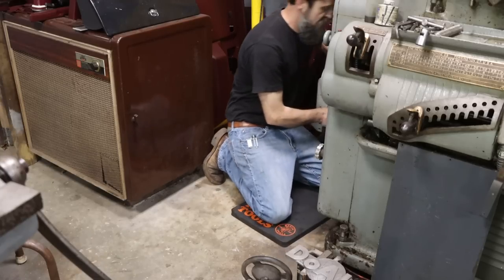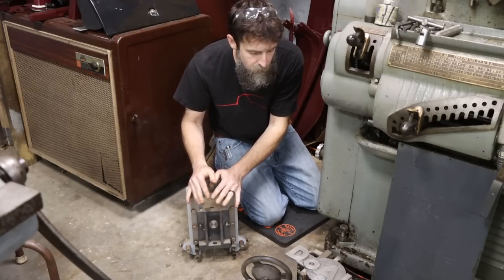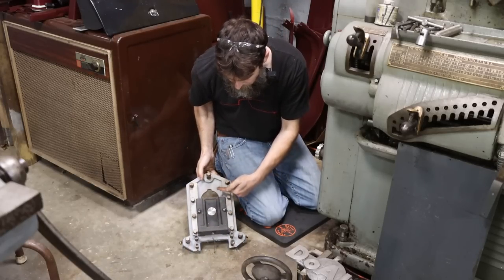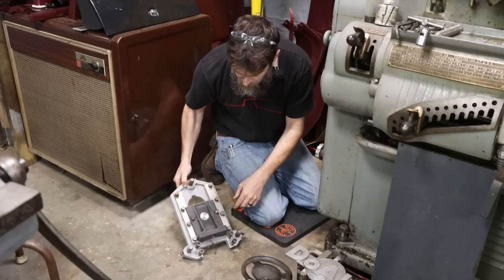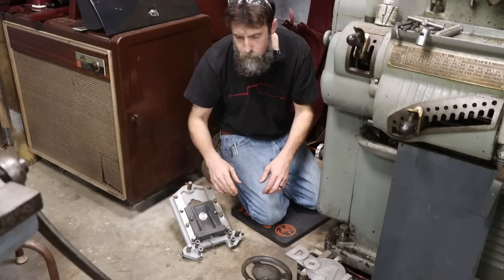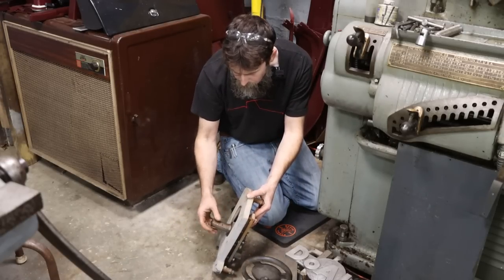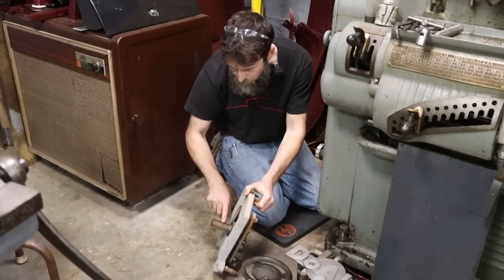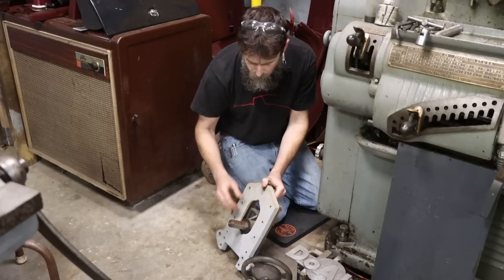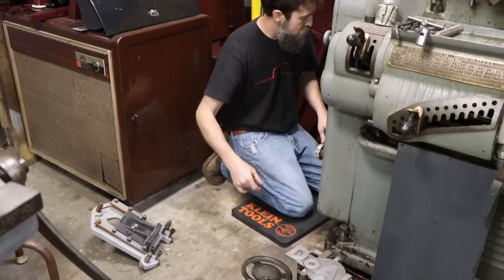Oh, look at this. This part here is the roller wheel, not the powered wheel, but the secondary wheel for the bandsaw blade. And this is where it does its adjusting, where you tighten the bandsaw blade. We had to remake these slides here because it was just so worn. You can go back and watch the video, I did it years ago. Anyway, that part we pressed out and remade this shaft here because it was just chewed into. All the bearings and stuff were gone on the wheels and it just totally annihilated all that stuff. So we did a lot of work on this thing. Not in the best of shape, but in better shape than it was when I got the saw.